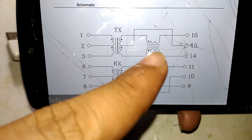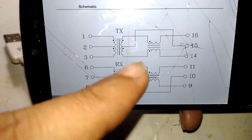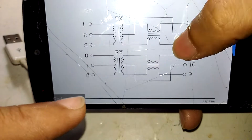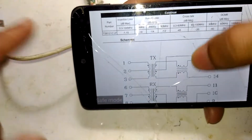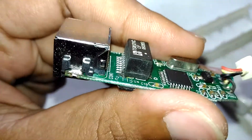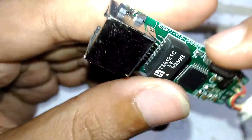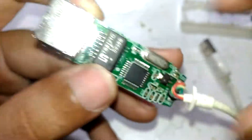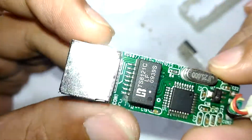The center tap is not connected to the line — it goes straight through — and that is where the isolation happens. The other elements appear to be for line filtering. That is why this thing is called an isolation transformer — there is no physical connection between the two sides. It is soldered at the moment, so I'm guessing there will be a center pole with all the windings on it, just like a regular transformer. Let me de-solder this and I'll be back.